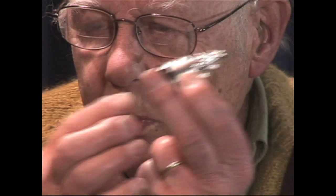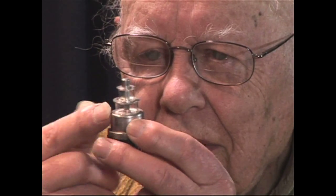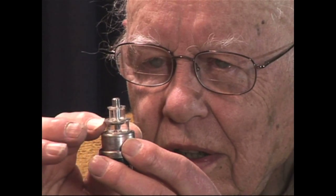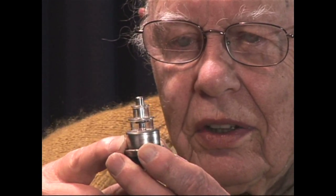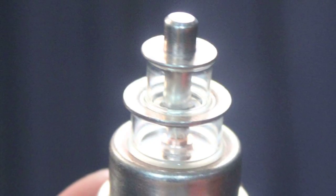It's an electron tube — it has a filament connected by a standard tube base inside. The outside of the filament and the cathode are connected to the big base; that's the cathode. The grid is a parallel wire set of grid wires, just one layer. The anode is just a copper rod and a seal. The problem was to make what they call a disc seal — not a trivial problem, since these tubes have to be processed at around 900 to 1,000 degrees and all thermal expansions have to match so the thing won't break in processing, yet still be strong enough to put into a circuit.